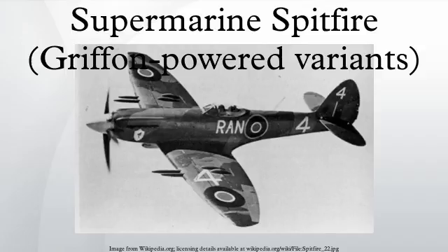The Mk-21 armament was standardised as four 20mm Hispano II cannon with 150 RPG and no machine guns. The Griffon engine drove an 11-foot diameter five-bladed propeller, some 7 inches larger than that fitted to the Mk-14. To ensure sufficient ground clearance, the undercarriage legs were lengthened by 4.5 inches and had a 7.75-inch wider track to help improve ground handling. The designers devised a system of levers to shorten the undercarriage legs by about 8 inches as they retracted, because the longer legs did not have enough space in which to retract; the same levers extended the legs as they came down. The larger diameter four-spoke mainwheels were strengthened, and post-war were replaced by wider, reinforced three-spoke wheels. When retracted, the wheels were now fully enclosed by triangular doors hinged to the outer edge of the wheel wells.